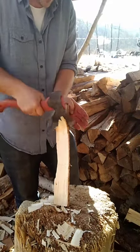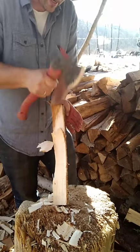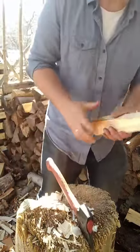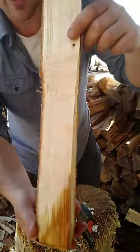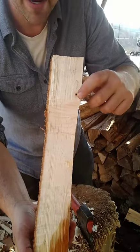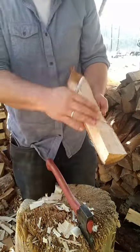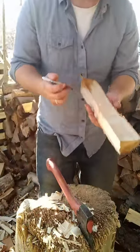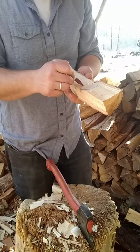As a beginner — or even for myself — it's nice to have a longer piece of wood than you need, because it lets you stay away from the ends and away from your fingers. It also lets you avoid unexpected things like this little spot where a branch pushed through. By having a longer piece of wood I can adjust to one side or the other if I open it up and there's some unexpected stuff.